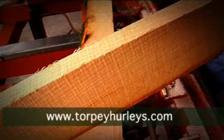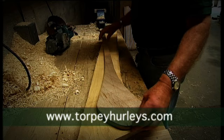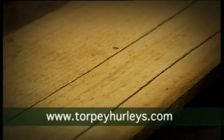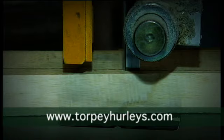The planks that are cut by the sawmiller are now stacked and left to dry and season for at least 6 months. The next step is to mark the seasoned boards. A skilled marker makes sure the pattern of the Hurley runs perfectly with the grain, ensuring a strong Hurley will be cut from the board. The boards are cut using the bandsaw. The familiar shape of a Torpey Hurley is now becoming obvious.